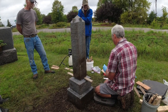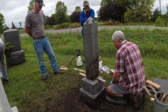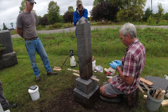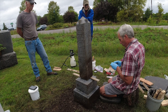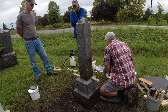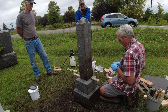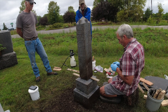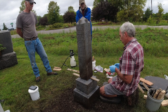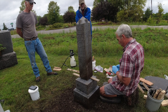We're going to have monument setting compound around the outside. There's no one right or wrong way, but some people think you should use mortar — however, mortar is not a strong bonding material, and a soft mortar especially is not going to give you any strength. They probably originally set this with plaster or lime mortar. They used lead in a lot of the formulas back then — lead was in everything: in all paint as a dust powder, litharge was red lead, white lead was in all the paint, it was in pipes.